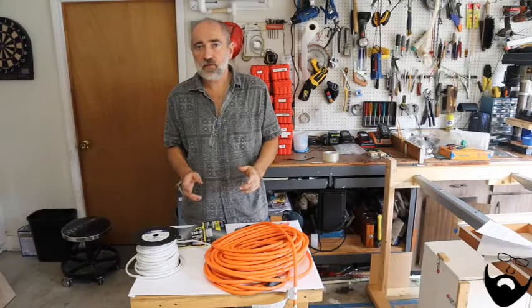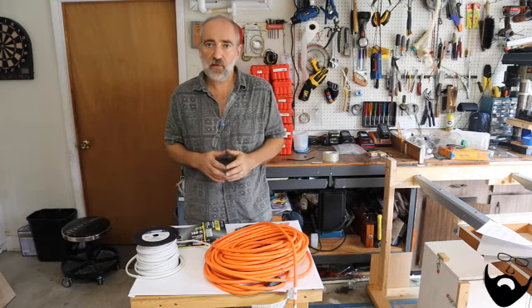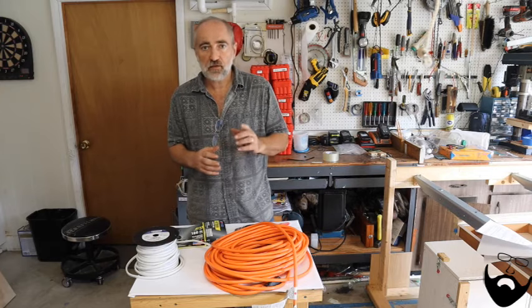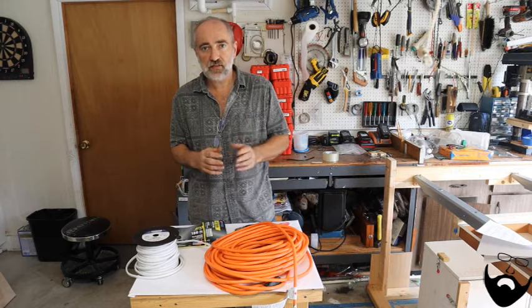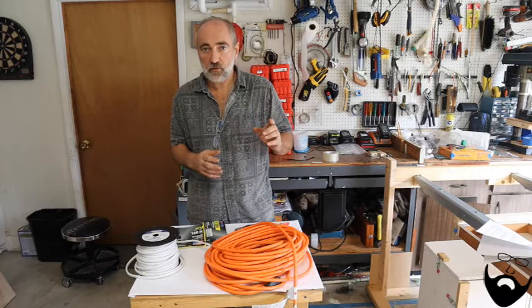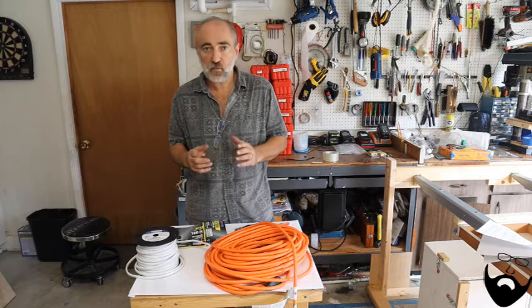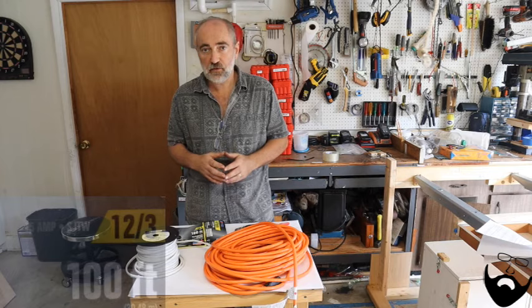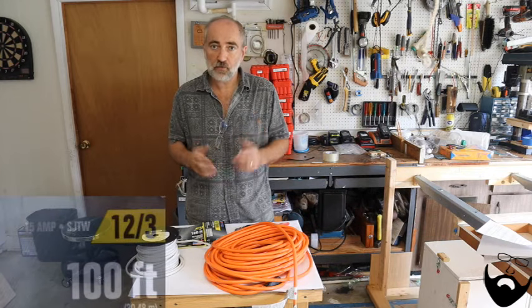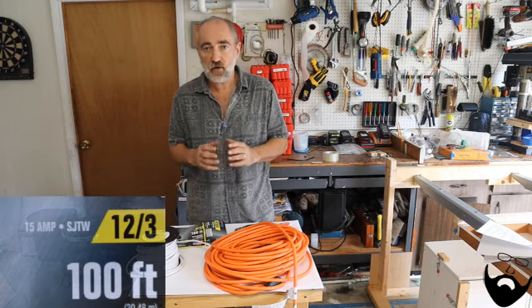So far I've covered the wire gauges you're going to need for your 12-volt system and for the wiring on your main electrical panel — from the solar charge controller to your inverter, and from your solar charge controller to your 12-volt fuse box. Now we're going to talk about what you're going to use for the AC part of your van build. You're going to need wire to go from your inverter to your AC outlets throughout the van. You could buy separate heavy gauge wire, or do what I've chosen to do and use an extension cord — not just any extension cord. This extension cord is a heavy duty 12-gauge extension cord.